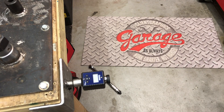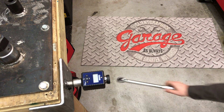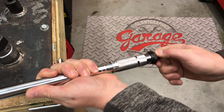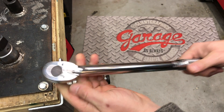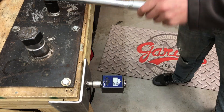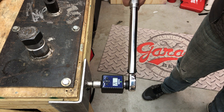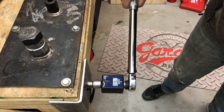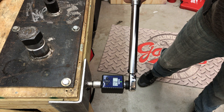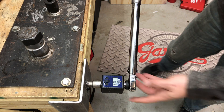That's from a three-foot drop. We'll give the torque wrench a little acrobatic lesson. Alright, that's some good drops. Let's dial in at 50 foot-pounds and test that torque wrench after exercising it just ever so slightly. After dropping it many different sides and angles, readings came in at 52.4, 52.4, and 52.4 — maybe it made it more consistent. All in all there's probably not a whole lot of difference; it's still not too bad, still not that much out of spec.